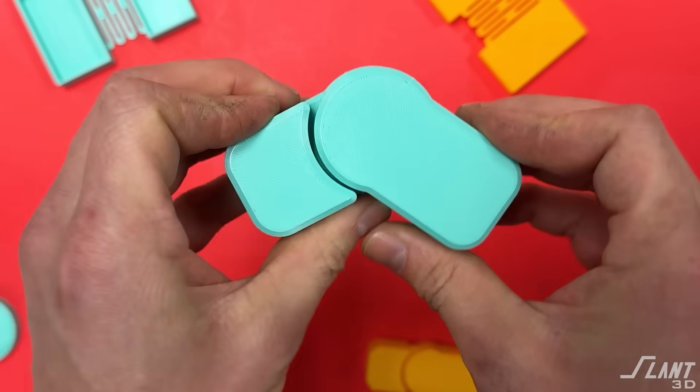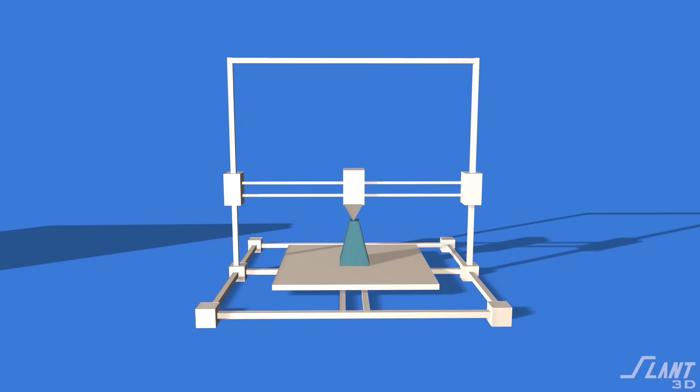Hopefully that gave you some insight into how to design different sorts of hinges. This is important because there are many applications where you don't want to be reliant on your particular 3D printer. If you wanted to upload something to a teleport plugin where you sell models but don't want to run a print farm — you upload the model and when a customer orders it, it gets printed and shipped — you need a robust model because those machines are not your machines. You want the model itself to be reliable without relying on slicer settings or material. Design well and all the slicer settings become irrelevant. This model, done well, can be printed at 0.1, 0.2, or 0.3 resolution with any infill and any material and still work fine. That is the power of really good design.